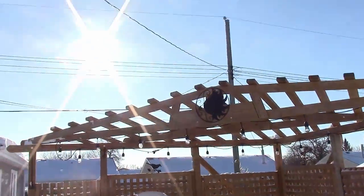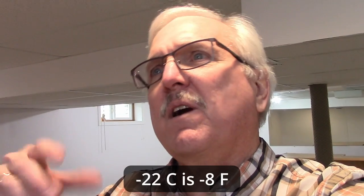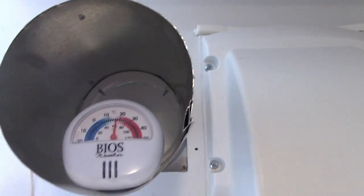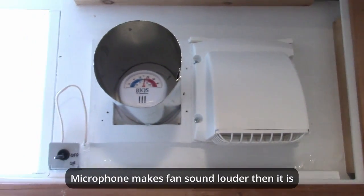Today we have maximum sunlight hitting that, so I'm just going to go downstairs and see how it's working out. I'm down in my basement looking at the unit right now. It's minus 22 degrees Celsius outside, so this thing has to take my indoor air, send it out to that device, heat it up, and bring it back in. The ambient temperature outside doesn't help much. The fan is running full tilt because we have the solar panel working, and we're getting around 17 to 18 degrees Celsius coming in. I can feel the warm air coming in.